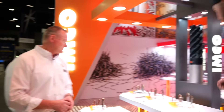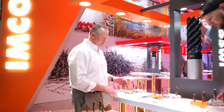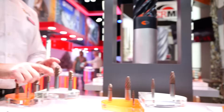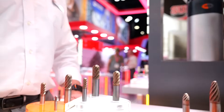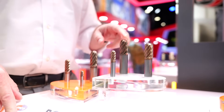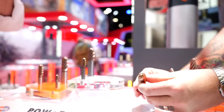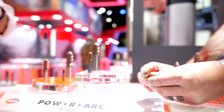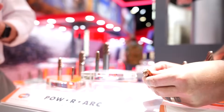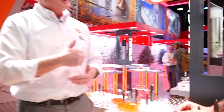And you guys are even into ball nose end mills, it looks like. Yeah, absolutely. What we really like about these ball nose end mills — we have a six-flute over there and an eight-flute over here. The key thing to these ball nose end mills, which we call the Power Arcs, is that half the flutes come to center. So with an eight-flute end mill, you're cutting on four flutes at zero, at the full radius. Whether you tilt the end mill 15 degrees or cut straight on perpendicular, you're cutting with a lot more cutting edges than your standard two or four flute.